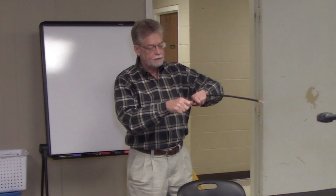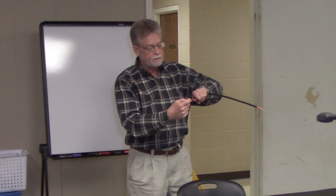So I just take a good sharp pocket knife and just barely pull that up all the way around the edge, that fringe of that copper, and make sure that it's pulled back and clean. It's a little more time consuming to do it this way. But once you clean that up and put your connector on it, that really makes soldering those four holes around there many times easier than if you don't do that.